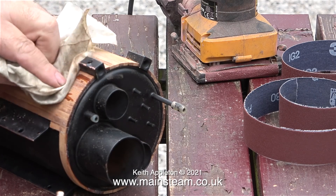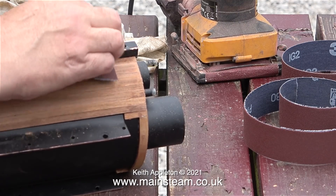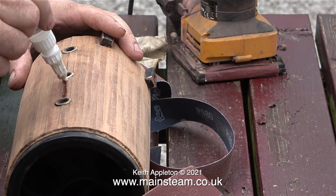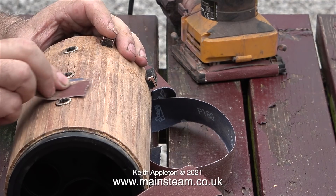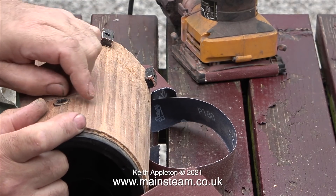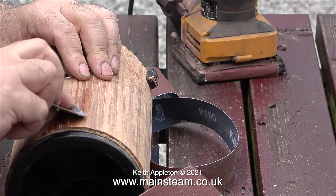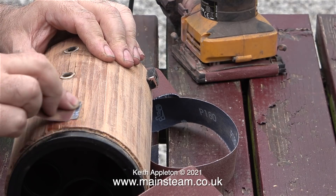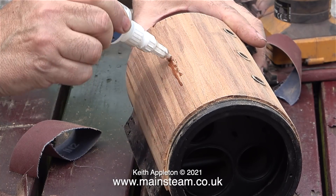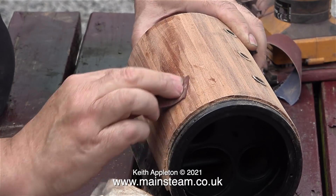The rest of it is handwork: apply some cyanoacrylate adhesive, wipe it off with the cloth, then use some coarse emery cloth to create small pieces of mahogany that fall into the gap and get stuck in place by the cyanoacrylate adhesive. When I videoed the process on the top of the boiler I didn't use the cyano, so the vibration of the orbital sander opened the gap up again — this time I filled the gap with cyano and now it should be permanent. I'm using 100 grit emery cloth for the first rubbing down and 135 grit for the second rubbing down where I go with the grain. Finally I rub down the entire boiler with the 135 grit, and every time I find a gap I fill it, then back to 100 grit and a final rub with the 135 grit emery cloth.